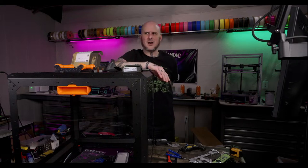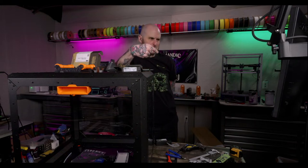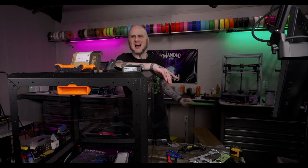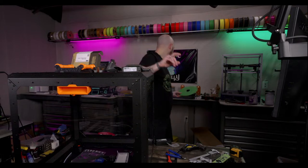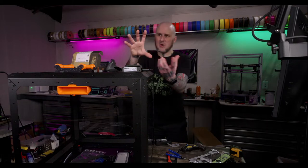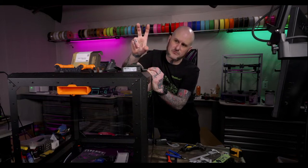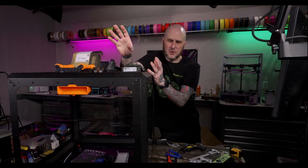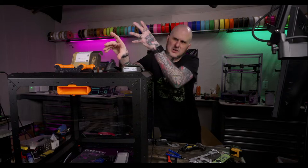I think Daniel Modbot's done a video on it. It's a little hard to explain quickly. I should do a video about it, really. Not switching with M600. No, it's not that. What it is is a multi-body part. You import the multi-body part into the slicer. You separate it into multiple parts. Then you delete the part you don't want to be the one color.